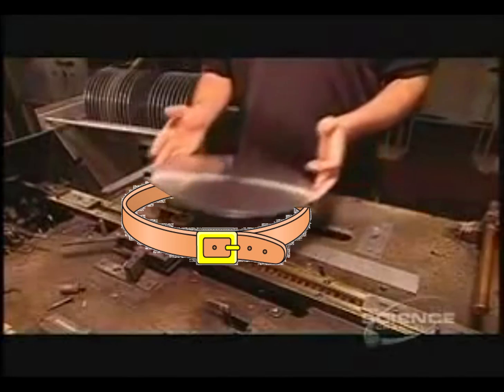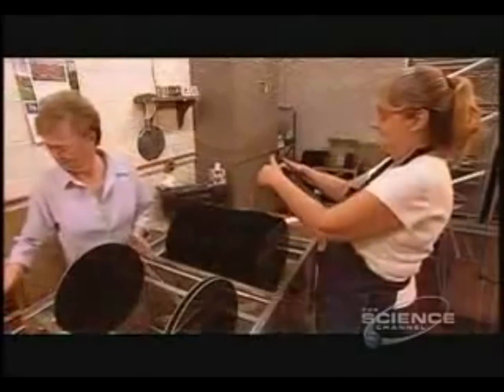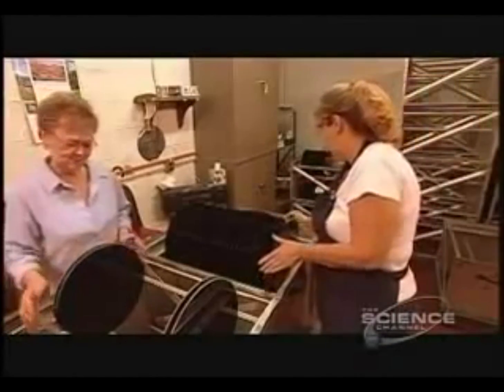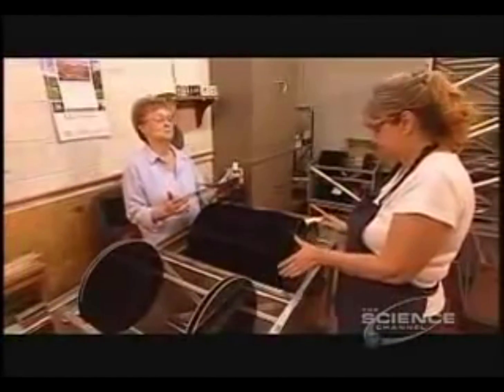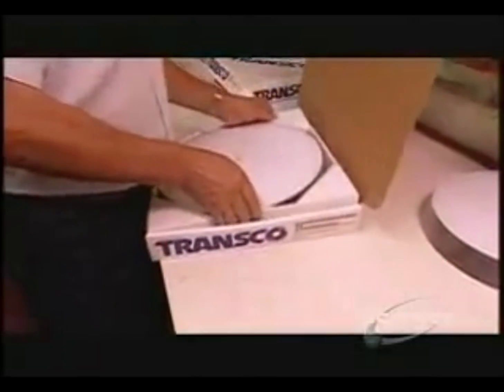They place the aluminum discs on a belt, and they ride towards a device that will coat them with lacquer. Rollers catch the runoff. At this inspection station, workers scrutinize each disc for flaws or pits. Even a tiny flaw won't be tolerated, so the rejection rate is high, about 50%. They recycle. Now the master discs are ready to take a trip.